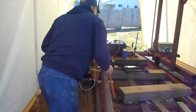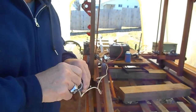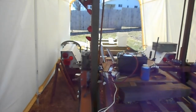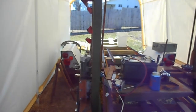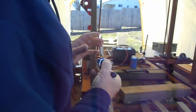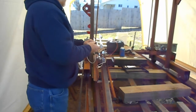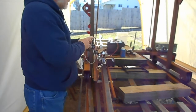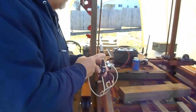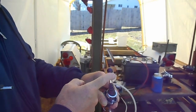Let me move my refreshment and adjust the camera. Here we go — we're coming back right now, this is at 5. It's probably doing a foot every 2 or 3 seconds. Plenty fast. I intend on having a switch in the circuit that won't allow a dead stop with power on — it will interrupt the power, probably to the orange wire on the switch, so it cannot continue to try and drive at the end of the track.